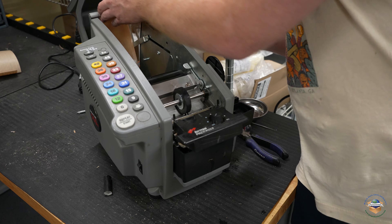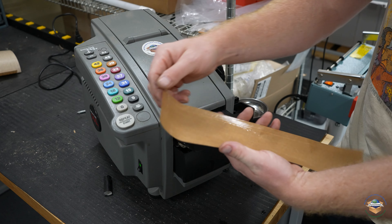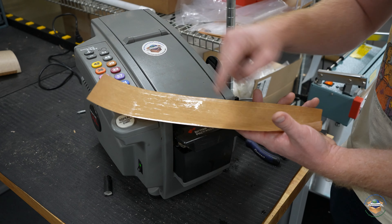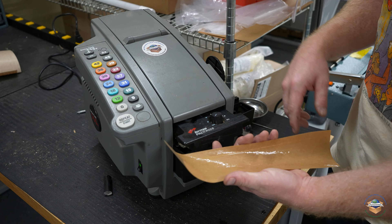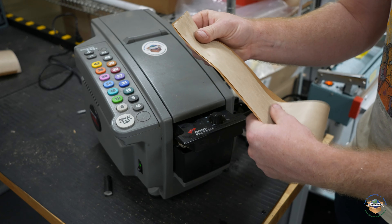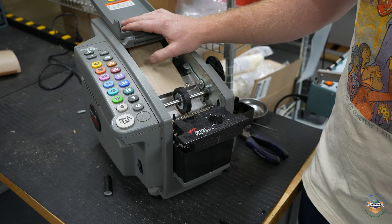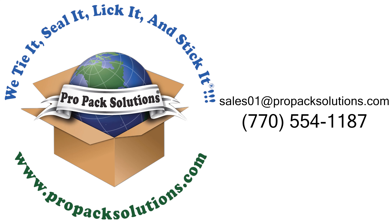I'm going to feed the machine again to check for moistening. I'll sort of arc the tape and rock it back and forth in the light — you just want to make sure it's predominantly moistened. Good moistening will be moist all the way across this tape. You can also check that it's dispensing the right length — I'll do a 12-inch piece and a 24-inch piece, stick them together, fold the 24 in half. As long as it's close, we're good. I'll continue to wipe down this machine and replace that sticker. Aside from that it's mostly cosmetic. As with most repairs, it's really just dirty machines — you keep a clean machine and you won't have to do all this work.